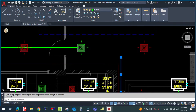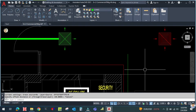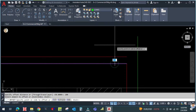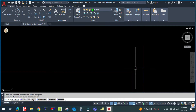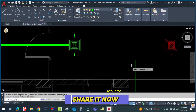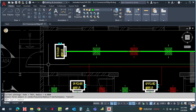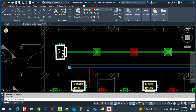Trim this line and draw this line as well. Offset this one — make a distance, just keep 100mm. Check how much it is — 163, so offset 163. Match this supply line and then use the fillet command. This is your chilled water return — continue it up to here.